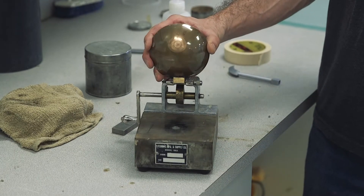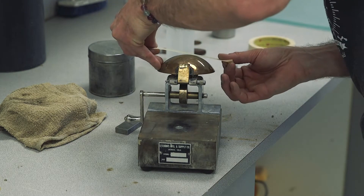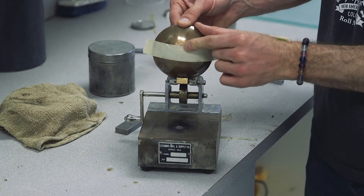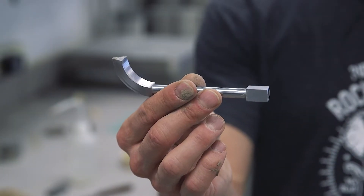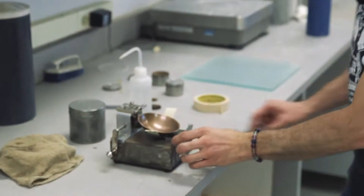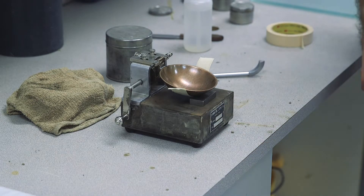To calibrate this device, we need a drop height of 10 millimeters plus or minus 0.2. We're going to take a piece of masking tape and place it on the bottom of the bowl such that it cuts that divot exactly in half. That point of contact should be cut in half, then we put it on the base plate. We can use either our grooving tool — which is 10 millimeters thick — or a calibration block, also exactly 10 millimeters thick. We stick it underneath the bowl and slide it in until we are in contact with the tape, centering it exactly at the point of contact.